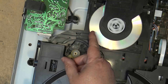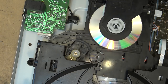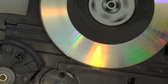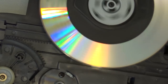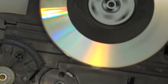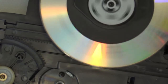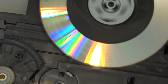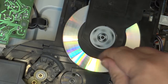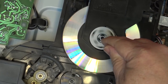You can actually see the wobble in the disc as it spins — you can see it in the reflection of the lights. The disc has some printing on it which affects it slightly, but you can see the slight wobble around the edges. It could be that the spindle is maybe not 100% true — it's slightly off center.